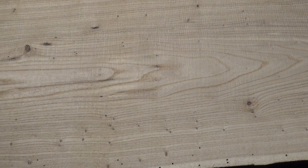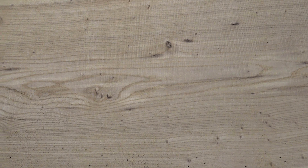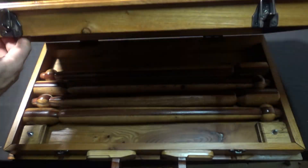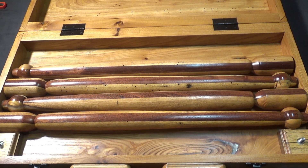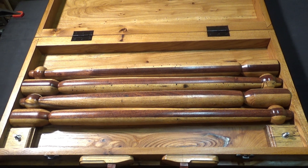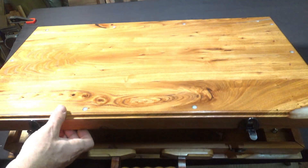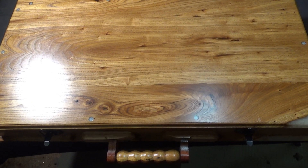It's an excellent choice for rustic design and has many use cases in general — all types of furniture. The average dry weight is about 2.4 pounds per board foot. The janka is around 500. End grain is semi-diffuse porous and the cost range is about $10 to $13. This is a briefcase table made of white walnut and mesquite — the white walnut obviously being the rustic gold-colored wood. We have a build video out on this, just showing you what the white walnut looks like in its finished state.